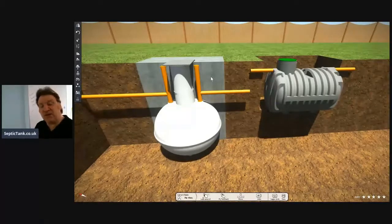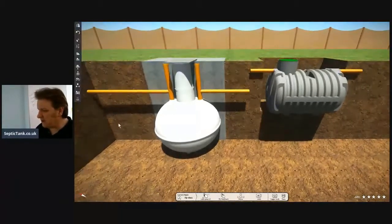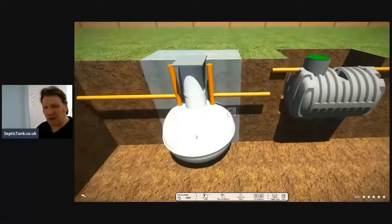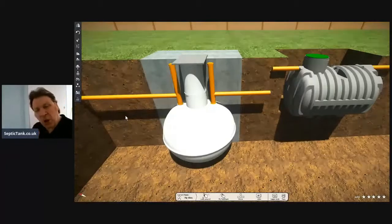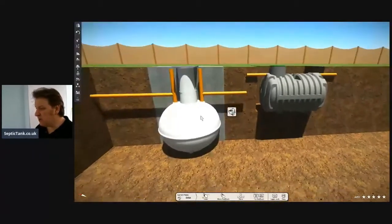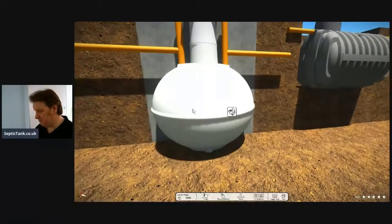You've saved your £150–200 up front, but then you've had to get a digger two to three times bigger than you'd need for a bullet septic tank. To put the concrete in will cost a minimum of £600 to £800. On top of that, in lots of cases you've got to put straps on — like braces — and at the bottom a concrete lintel to hold the tank down.